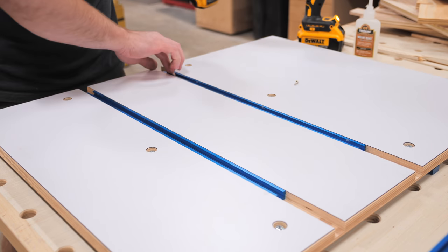Test fitting the hood I realized the back fence was lower than the front fence due to the double t-track, so I added spacers there. I also wanted the hood high enough to accommodate pretty much any thickness of wood I'd typically use, so I added additional spacers at both ends. I laid out hole locations for the t-slot bolts, drilled those holes, then modeled a custom dust port in SketchUp and 3D printed it — only took about 20 minutes. After confirming the fit with my dust hose I drilled a hole through the top of the hood to accept the dust port, then reinstalled the hood temporarily screwing it to the back fence for testing.